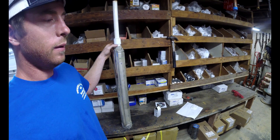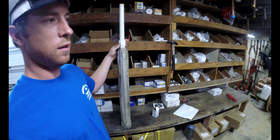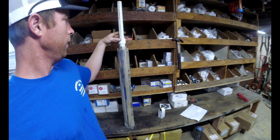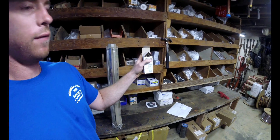The main point of emphasis when attaching any kind of pipe to a pump — especially right here above it, where this particular fitting is going to see the most torque — is to have a solid, rigid fitting. What we prefer is these stainless steel check valves made by Simmons.